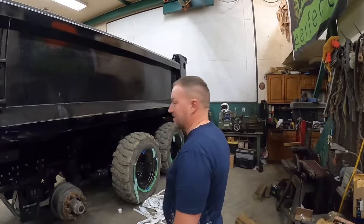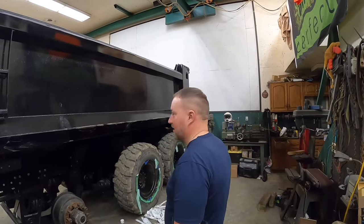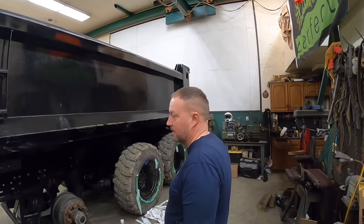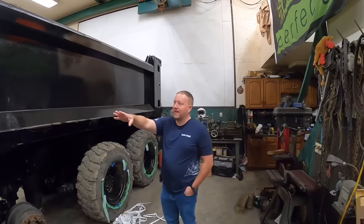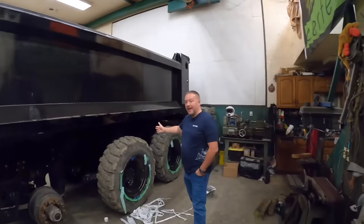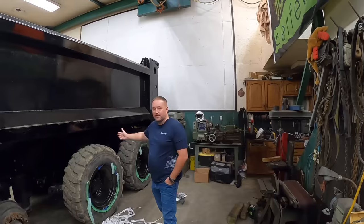Overall, it looks fantastic. It looks great. You got the bed on, the CA looks good, or how you're going to set all that up. Are you going to explain what that is? Well, there's a couple of formulas that go into putting a bed on. So the back of the cab, which you'd start with, you can actually go to the center of the axle if it's a single axle, and you're going to go to the center of the tandem if it's a tandem.